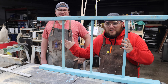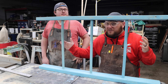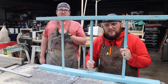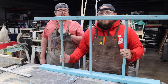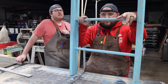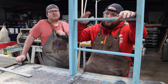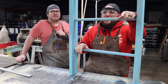And there you have it — your blanket quilt ladder holder for your home. It's about $15 worth of materials and you can make this in an afternoon. If you need a space to work and tools to use, check out the Shack Makerspace here in Kokomo, Indiana — $35 a month for individual membership. One note: this came out a little short. If you make it yourself, I would make it longer — but we were going for the absolute cheapest build using one two-by-four and a couple dowel rods. It still works and holds blankets.